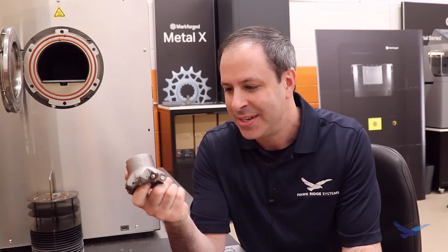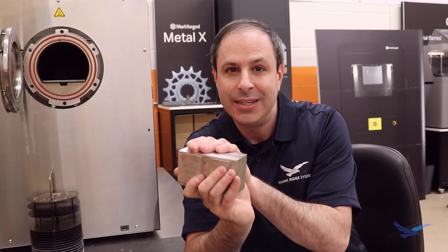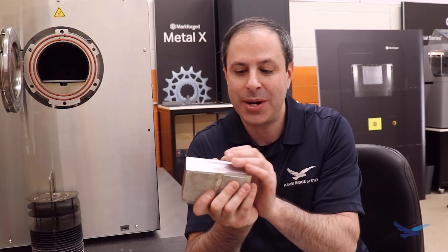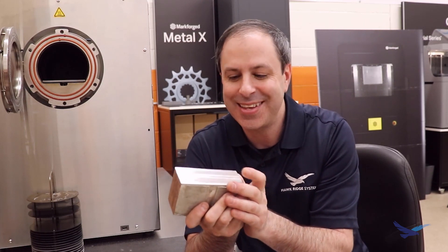Wow, that was exciting, and I mean it. I was quiet during the video - I've been wanting to cut with this tool ever since I printed it, so I was just watching and cheering it on. To recap: we talked about design, prototyping, 3D printing and post-processing, and then we actually cut with the tool. Looking at it, there's some evidence it was used, but everything is fully intact - a really positive test. Our block of aluminum is a little shinier now. We started with some surface cuts, then went to 5 thou, then 15 thou, then up to 30 thou. You can hear the operator in the video saying 'wow, that thing can cut' - he was pretty impressed, coming from more traditional cutting tools.